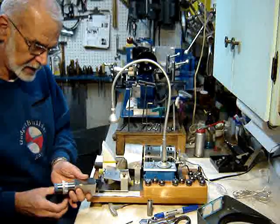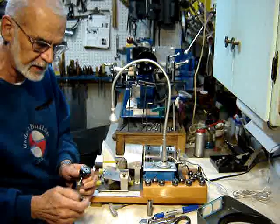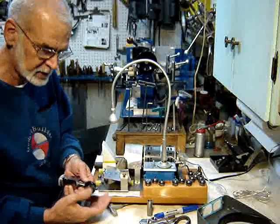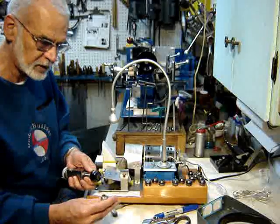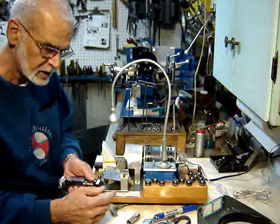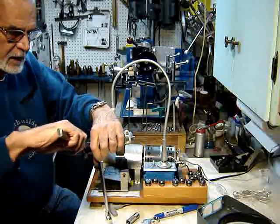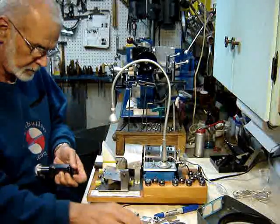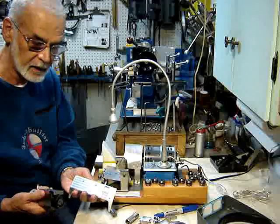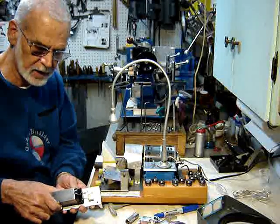To set it up, I put the correct collet in the chuck. This is a number 23 drill, about 150 thousandths. You just make it finger tight. Use this little gadget to push on it and set the extension of the drill from the collet. Then tighten the collet. We use a separate jig to set the lips horizontal and also to set the extension of the drill.